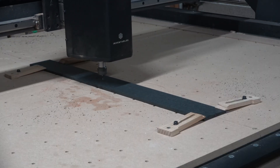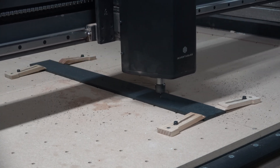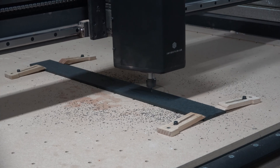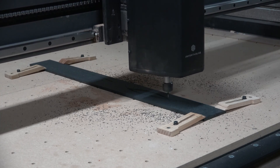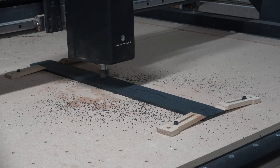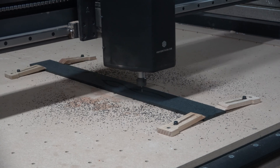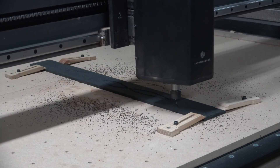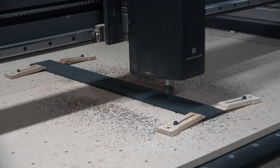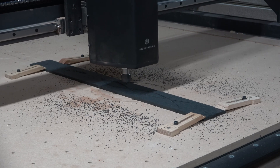There are going to be multiple cutting operations to make this fretboard, and I follow a very specific order that I find gives the best chance of success. The first operation is cutting the inlay pocket for the design that'll be inlaid on the surface of the fretboard. Several bits are used in this process: first a 1/16-inch bit to hog out most of the material very quickly, then I'll switch to a 1/32-inch bit to cut the fine details, which takes a little bit longer.